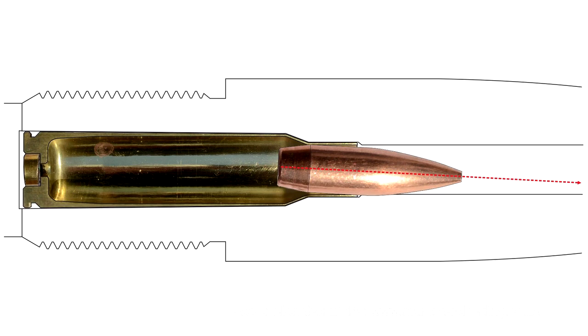There is a misconception that a bullet with run-out can be straightened in the case — you actually get tools for this. However, when this is done, the neck tension between the case and bullet is altered and the grip on the bullet is lessened. The result is variations in neck tension amongst cartridges, which in turn creates variations in pressure and bullet speed, and ultimately has a negative effect on accuracy.